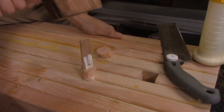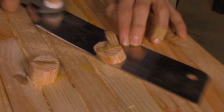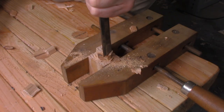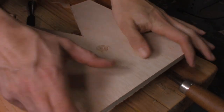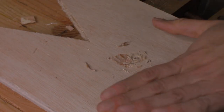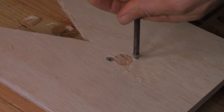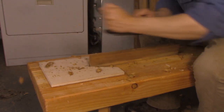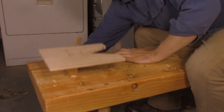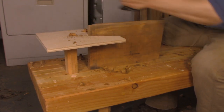And now, we're just going to make the same round tenon that we've used for all of our Woodworking for Humans projects so far. So once you've got it laid out, chop it, trim it, glue it, wedge it, and flush cut. And then you can add a screw on either corner of the post, which will prevent twisting and just reinforce it a little bit more. Now you have a mobile planing stop that can hold narrow boards on edge even when they're very wide. You can tap it up and down to accommodate whatever size you need, and it'll handle narrow boards and wide ones.